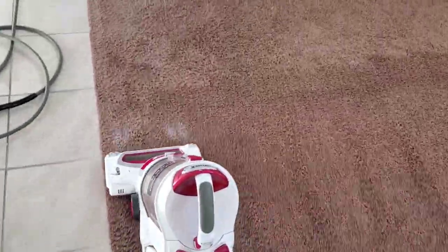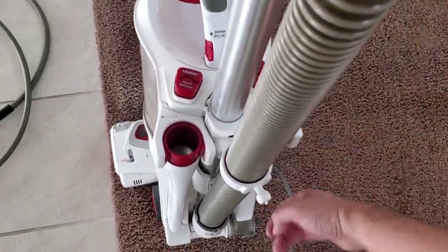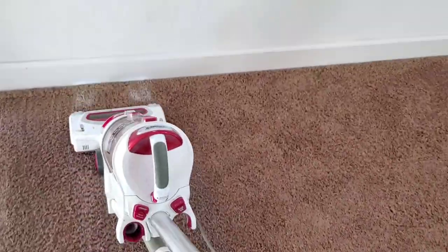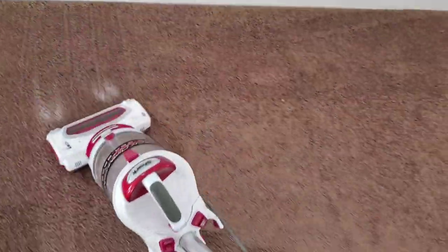So something to think about if you have that setup. You've never had them professionally cleaned. One thing you gotta know is just to be extra safe, I always instruct my clients to leave them off the carpet until the following morning, at least, just so you don't risk trapping any moisture in and causing future problems. I told them they can bring one in and place it on the kitchen tile, but it needs to wait probably about 4 hours, so that way the tile and grout can dry completely. More so the grout, because we're sealing the grout today.